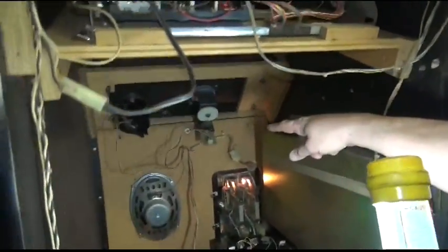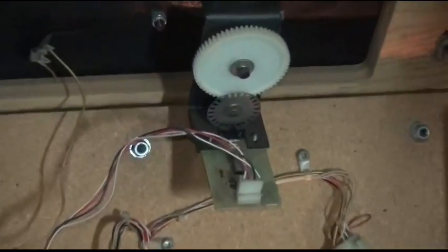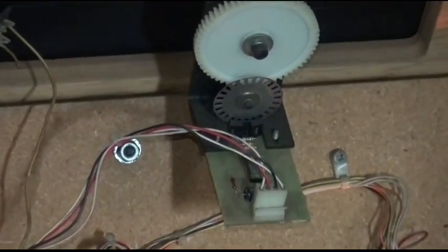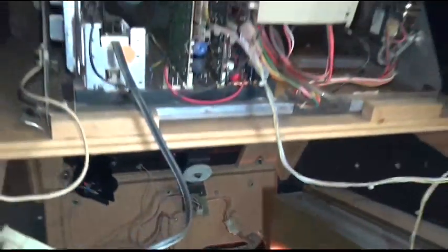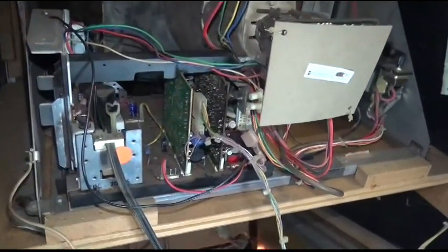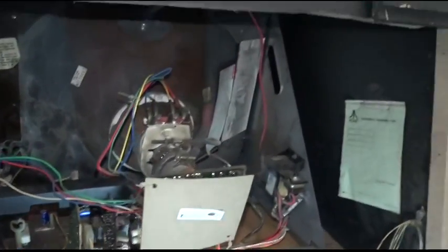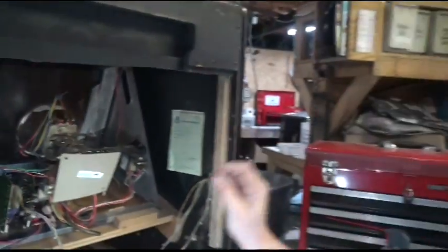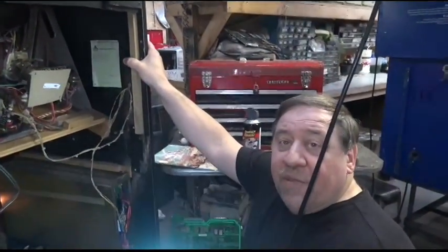Frank, look underneath here. There's the optic for the steering board. We took that off and cleaned it and reflowed solder because that gets cold solder joints, and then your optic is intermittent. We have in here a 4600 chassis with zero burn-in, a crystal clear, beautiful, full-color picture that's razor sharp, all rebuilt with new capacitors. Are we ready for the sound effects?